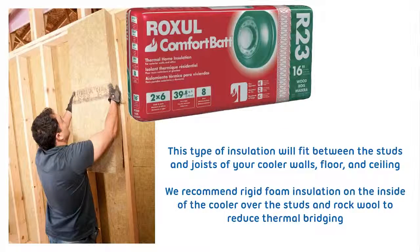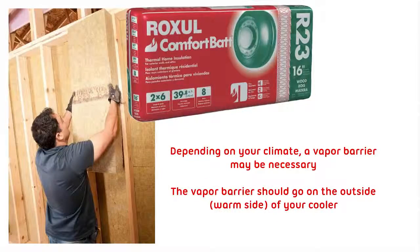An alternative insulation material is rock wool or mineral wool. This type of insulation will fit between the studs and joists of your cooler walls, floor, and ceiling. We recommend rigid foam insulation on the inside of the cooler over the studs and rock wool to reduce thermal bridging. Depending on your climate, a vapor barrier may be necessary.